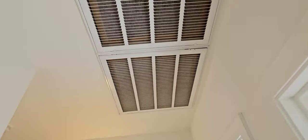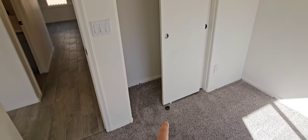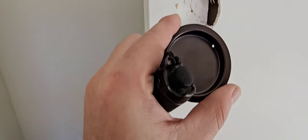In the hallway we've got our air filters — nice and clean, a little bit of debris in the registers but nothing too crazy. Bedrooms nice and clean with a fresh coat of paint, electrical outlets are working. Door handles are just falling out — there was nothing holding one in. You stick a penny nail down into those holes, but before you do that, put some sealant around the edges so it doesn't rattle. Not a big deal.